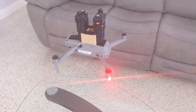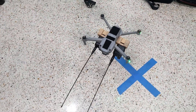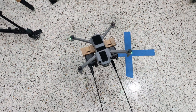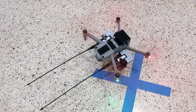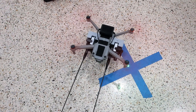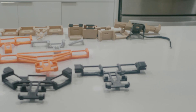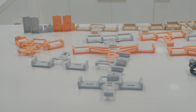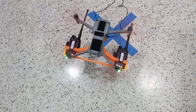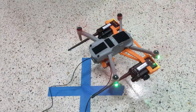That's the V5. And then I ended up mounting at the bottom. It basically became a trial of adding and removing things from each of the prototypes just to see what would fit best — at some point removing back parts to lighten it, then realizing there were failures at a certain failure point. I settled on this kind of shape — this is version 13 and 14, roughly equivalent. But then I started removing the bottom edges for the clips just to get a simpler thing. I tried removing the back part but realized that was necessary, otherwise the drone would snap off.